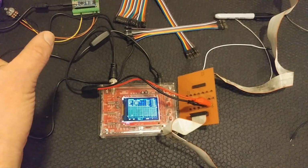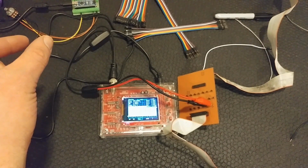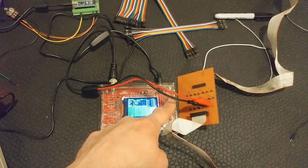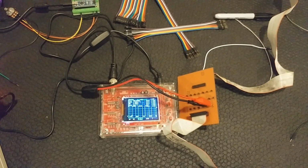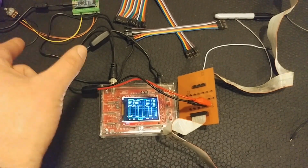we see that keeps shrinking, getting a faster and faster frequency as the motor accelerates. And here we can even adjust the time scale again and get a better view of it. And now it's at 720 hertz. So we started off at half a mile per hour at 72 hertz. Now we're at 5 miles an hour, 10 times faster, 10 times the hertz. Story checks out. Cool. And we saw that it does indeed track the current motor speed.